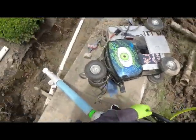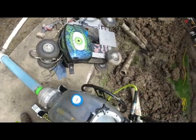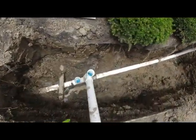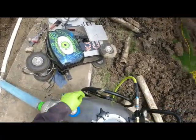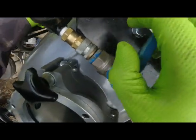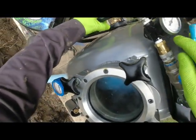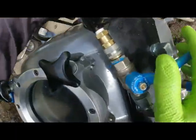Got a lot to cover to get to this point, but again this is the exciting part — my heart is pounding, the clock is ticking, and away we go. Sweet, it's already going — there it goes, it inverts it into the old pipe. What does that mean? It basically turns it inside out as air inflates it into the pipe, rolls it along, pushes it in. You can see the wheel spinning, which means it's actually going in. Nice.